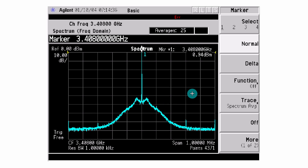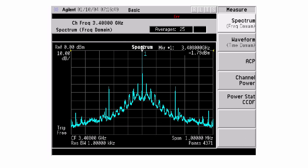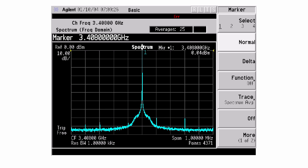I was hopeful I could do something to improve that phase noise, so I did a bit of research and work. Here is our 3408 MHz output from the synthesizer. As shown in a previous video, when I put my finger on the synthesizer board and move it around, I get some spurs that show up — clearly the 3408 synthesizer is a big contributor to the phase noise. For reference, here's the output of my HP8673G 2-to-26 GHz signal generator, to show that things can be better with a good design.